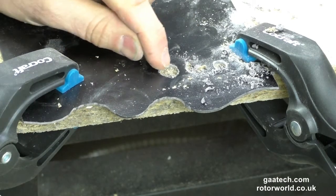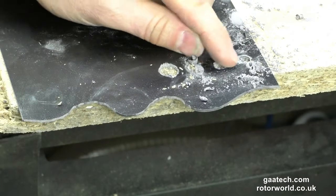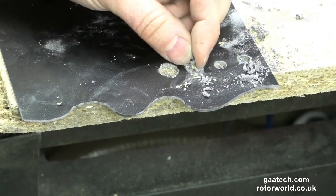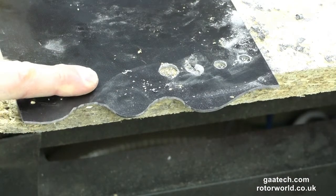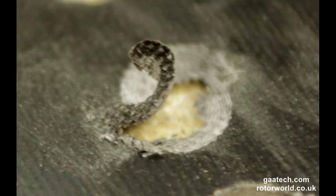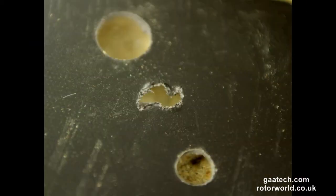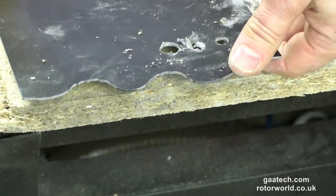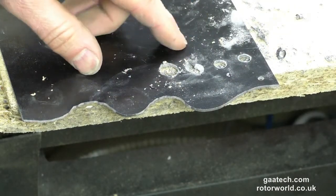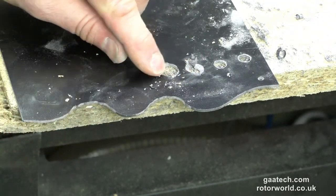Okay, that broke out as well, so I think the secret to getting a nice hole in drilling is go up in small stages. I've got a stills picture of that breakout and I'll blend it into the video somewhere. Going from a 3mm to 8mm gave a reasonable hole. The backs feel good, but jumping up too quickly, you can see here that the FR4 didn't like it, and on the surface finish, you can see there's breakout.